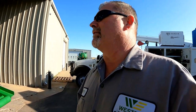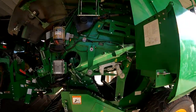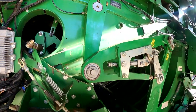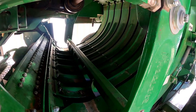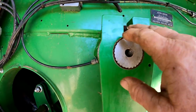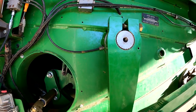First we're going to be looking at an L340, and this baler I believe has got about 15,000 bales on it. Here's our L340 and we've had it in the shop doing some work. We've had a little bit of trouble with this rocker shaft here and this arm which drives this feeding system. We've put a new arm on, a new shaft, and got that all tightened up and secured.